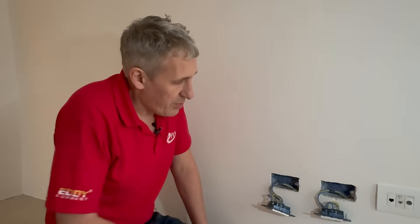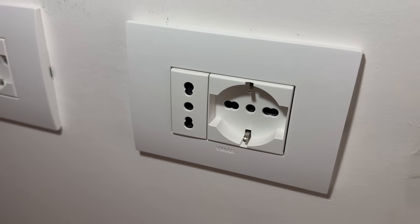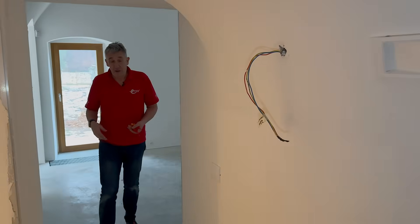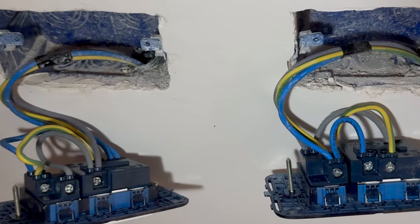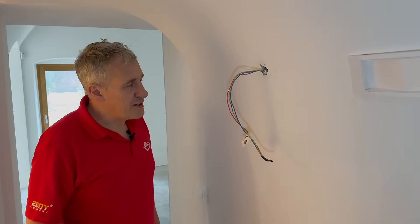Please comment if you do wire these up — whether you're allowed to add an additional socket just by taking a conduit from the existing one, or whether you'd have to chase up all of the floor and take it back to that box. What's also interesting in that socket: the line conductor was grey, which is a phase colour, and we are on a three-phase system, so that could be the natural fit for that.